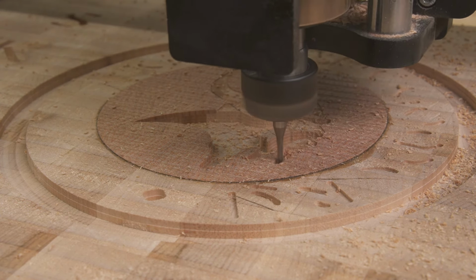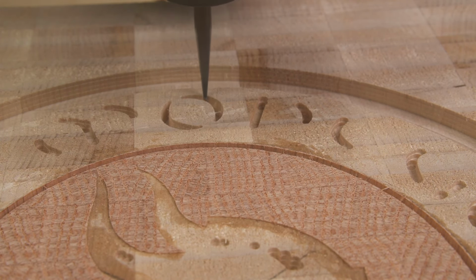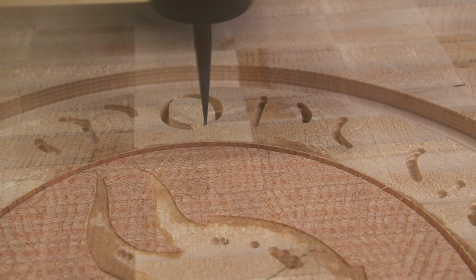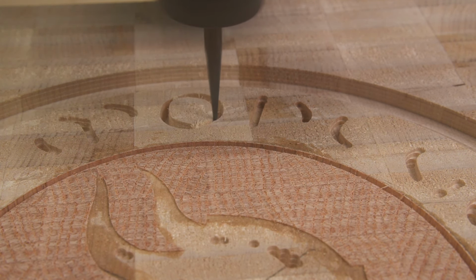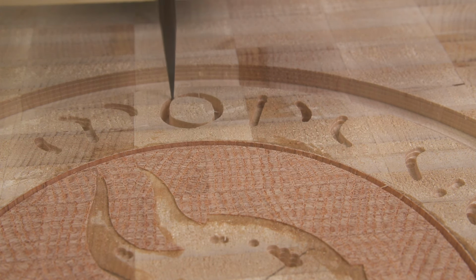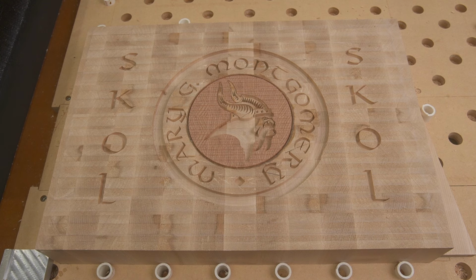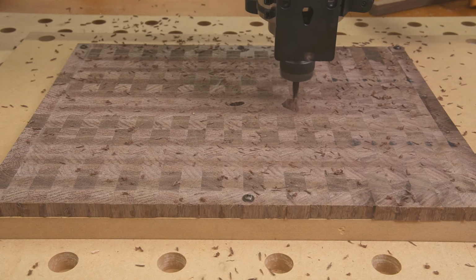For your Z, if you're cutting too deep or too shallow from that, then whatever settings you have is not really going to matter if it's not accurate. Same thing for your X and Y. If you're cutting more or less than what you're asking it to cut, because the inlay is a mirror image, a flipped image from the pocket, then if your machine isn't square, those two cuts will be skewed from each other and will not fit properly.